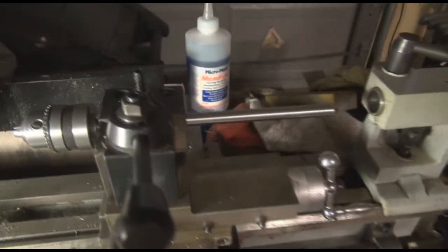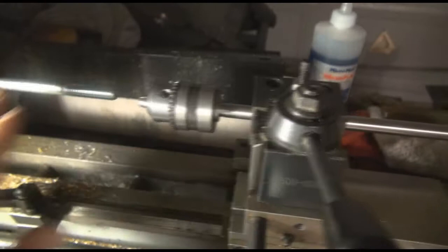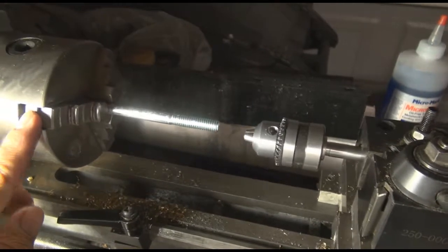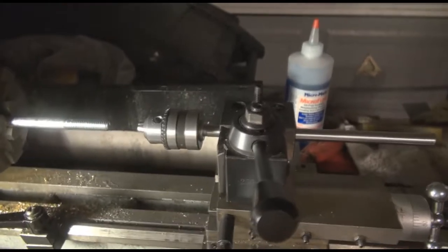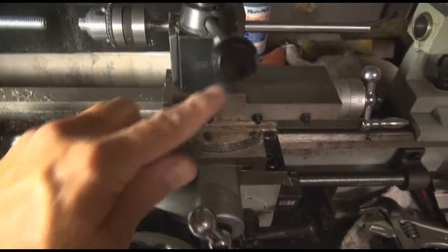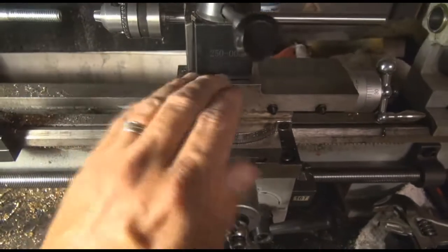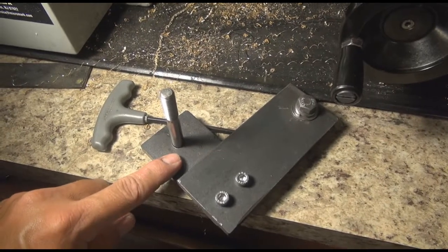Now this shows the setup back the way it would originally be. However, this is for doing some special end-type drilling. If you have a piece of stock in here that you're working on, you can turn it and make sure you've got wherever you need the hole drilled. This will drill it on the outside edge, center — wherever. You just adjust the depth by doing this, and the height you adjust with this screw right here. This is the actual piece I made as an adapter. It needs to be underneath where the plate goes that this rests upon, because when you put a piece of steel across here, that raises this up — so you've got to have this drop down to the original level. This will put it at the original level so that everything works appropriately.